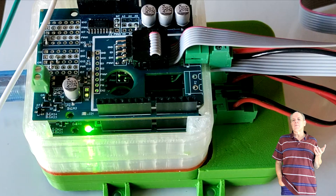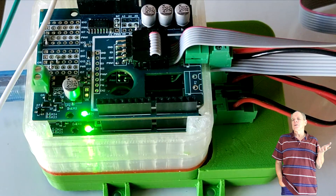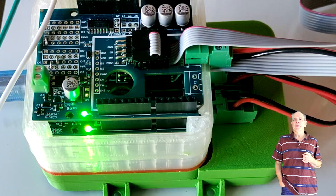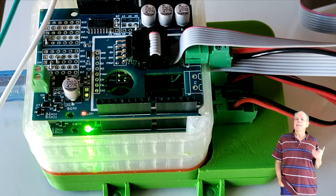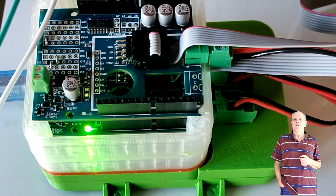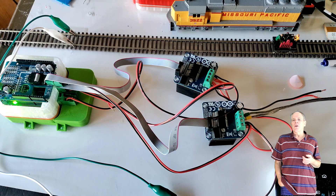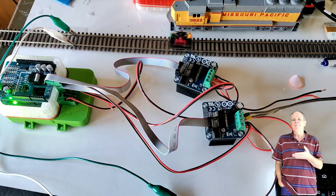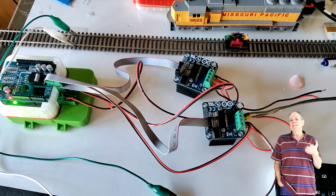Let's test it. I send a loco command with speed step 5 forward to address 55. The LED comes on in green and not very bright, indicating a low voltage on the track. I increase the speed to 50 and the LED is much brighter. I change the direction to reverse and the LED changes from green to red, indicating reverse track polarity. As I reduce the speed, the LED gets darker and turns completely off at speed zero. To test analog current, I put my little Bachmann gandy dancer on the track — it is simply too small for a decoder, so it runs analog only. It moves back and forth with DC from the DCC X command station, controlled using a DCC decoder address.